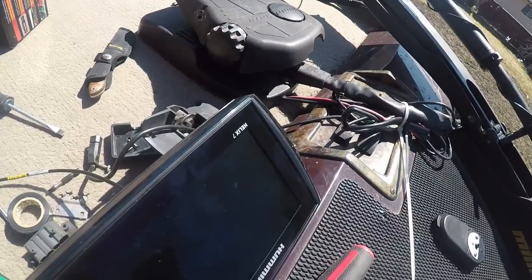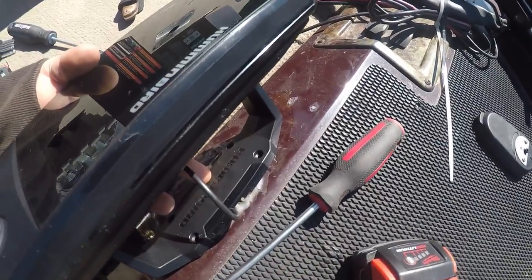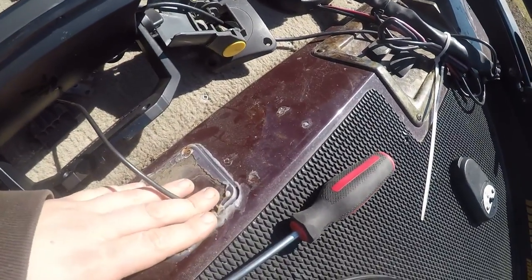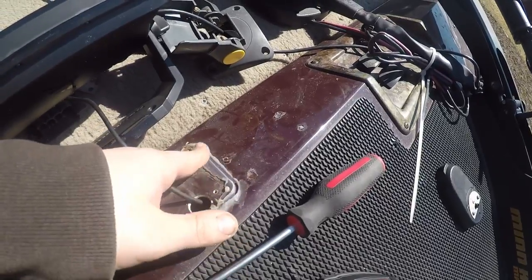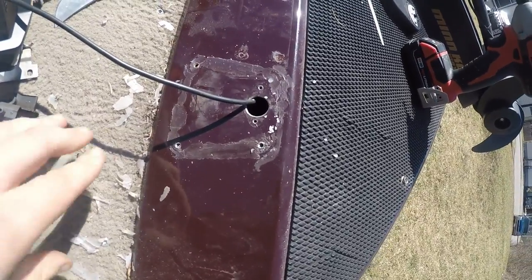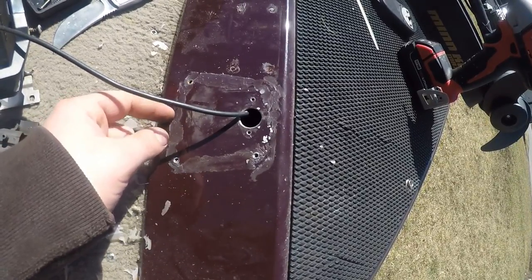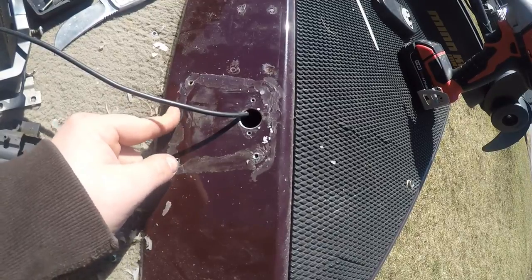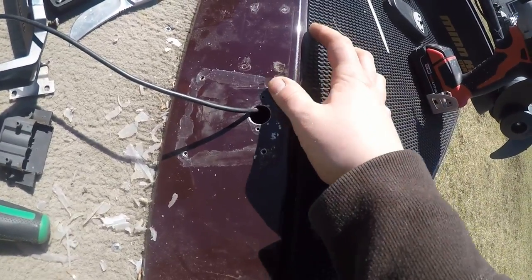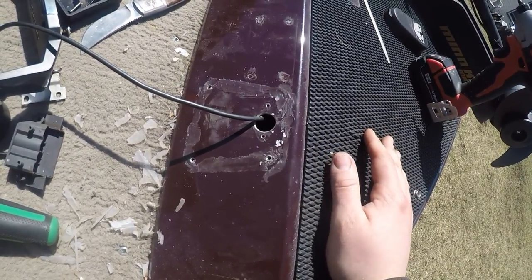This has got a little groove here so that's going to hide the gap. It looks like it's been siliconed before, so I'm going to re-silicon it, but first I'm going to scrape all this out so I can have as smooth a contact as possible while I try and hide the blemishes. I mean, it's a boat — you're going to get wear and tear. I got most of the silicone pieces off. I'm just going to go around and silicon it afterwards to keep the water out.